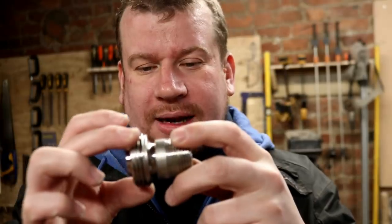One of the first things I have to do today is weld RJT fittings to some threaded nipples - like that, look at that lovely fit. That will allow me to have an RJT fitting on the plate heat exchanger, and from there we can come around the corner and meet up with the pump, which I also have to apply an RJT fitting to. Then we will go up and connect onto the tank as required. So I'm going to get straight into the nitty-gritty - we're going to fire up the welder and we are going to weld!